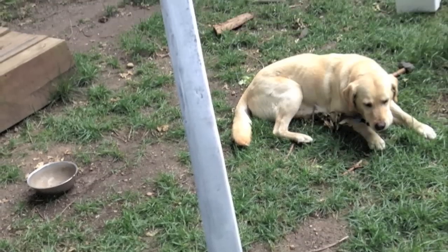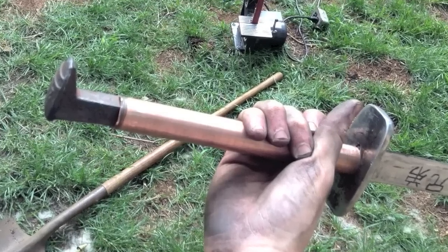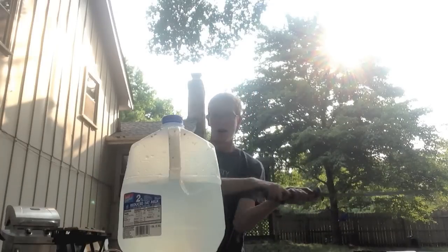After hand sanding, the last thing you need to do is put a handle on it. I put a piece of copper pipe on it — you can use PVC or wood. Then you need a pommel; I used the end of a railroad spike, threaded the end of the sword, put threads inside the railroad spike, and that's all you have to do for your handle.